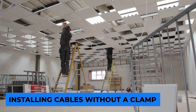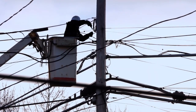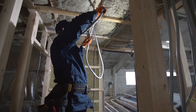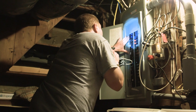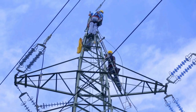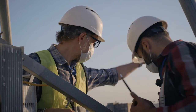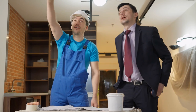Installing cables without a clamp: installing any cable without a clamp can lead to disastrous mistakes. If the cable is not clamped, it might wander around and cause strain on connections. If the wires brush against a sharp edge in a metal box, insulation can be cut. Wires must be connected to the box using an approved cable clip. Cable clamps are not required in single plastic boxes, but the cable must be stapled within 8 inches of the box. In a bigger box with built-in clamps, the cable needs to be stapled within 12 inches. Ensure that the cable's sheathing is trapped under the clamp and that about 1/4 inch of the sheathing is visible inside the box.